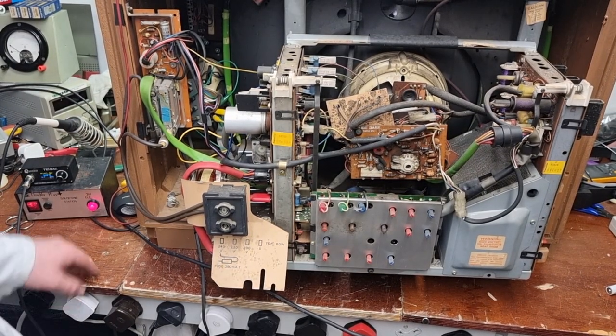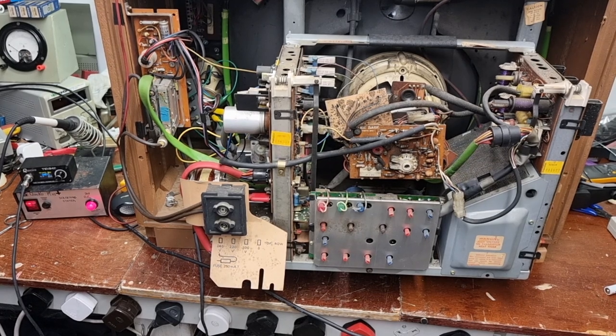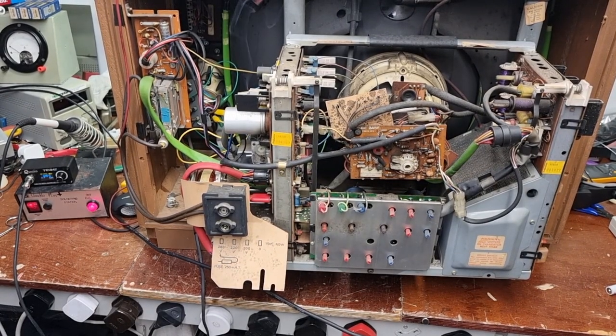We're on. We are on. So we shall look for colour bars. Well, I guess I may have to rethink my 3-watt resistor in there. It's not enough. As we can see, it's glowing healthily. We do have HT, but it's probably a bit low. So, I think, yeah. Don't think that's good enough in there.